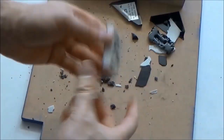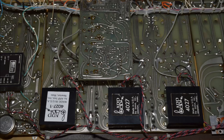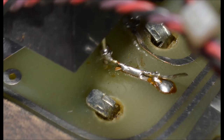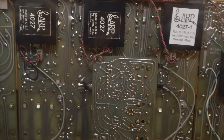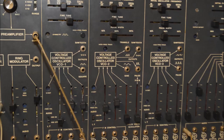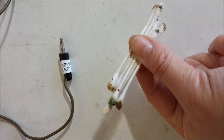I'm not afraid to crack these modules open to repair them, as I've done in several of my prior videos. But in this case I'm glad we found an acceptable workaround, because this oscillator module had already been replaced at the ARP factory, and the pads and traces that connected to the main board were damaged in that process. So we were able to fix the problem without risking doing any more damage. Plus we get to keep the oscillator in its plastic shell and preserve the original look of this historic synthesizer, which is important because you can see it through the plexiglass case and it's going to be displayed in a museum. I've also replaced nine broken slider shafts and added some missing slider caps. Don said tar from the smoky clubs he played in had kind of sealed up the plexiglass case — well, it also went into those sliders, because the ones I opened were really nasty inside. All of this grime came out of just one of the sliders, and that one wasn't even the worst one.